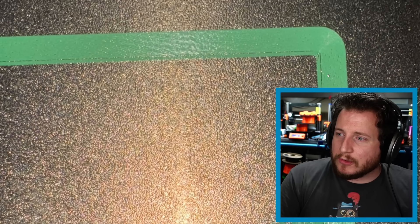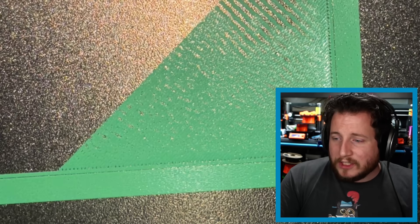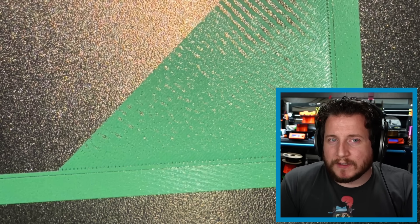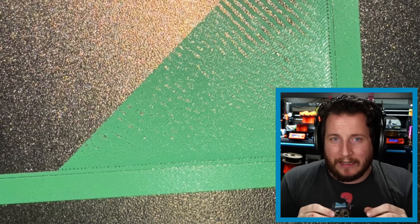This can also be indicative of a nozzle clog. While the user says their Z offset is fine, I'm seeing some random bits of under-extrusion and no sharp corners, which leads me to think this could also be a pressure advance value issue. We need to retune this Voron — keep an eye on that gantry during the first layer. If it's not moving a lot, try adding 0.05mm to that first layer offset.